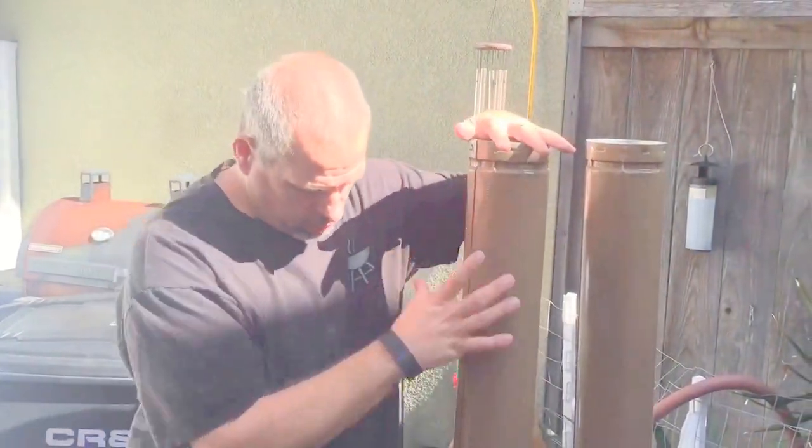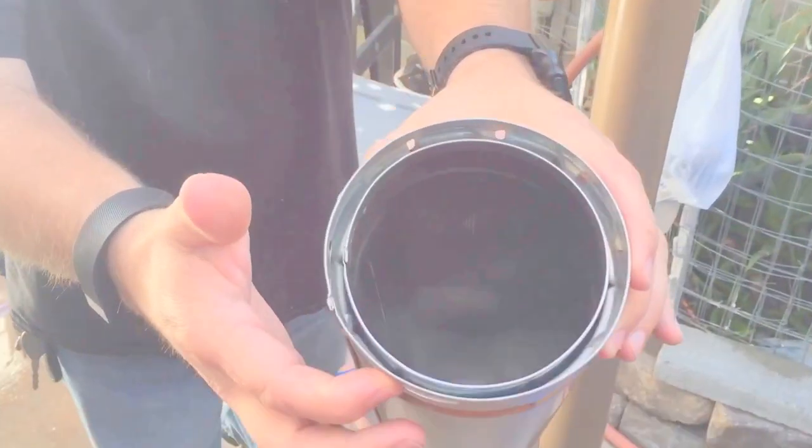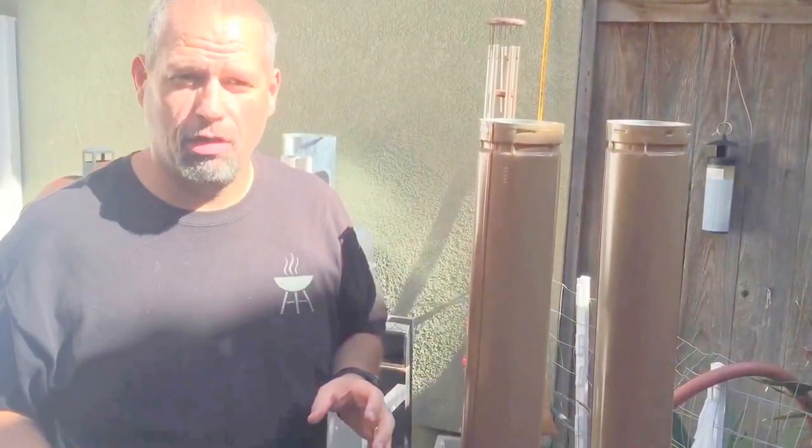This is some four-foot double wall insulated chimney pipe. I spray painted it to get as close as possible to match the color of the house. I've got about 20 feet of sections of this that I'm going to assemble along the wall and mount to the side of the existing chimney, so that eventually most of the smoke from the Traeger will vent out to the top of the roof.